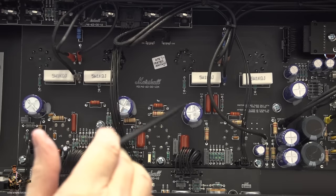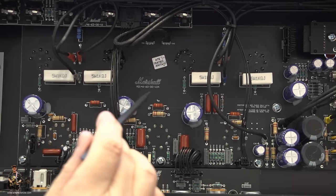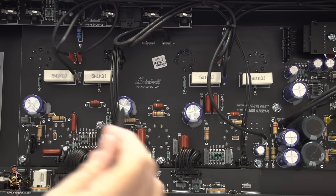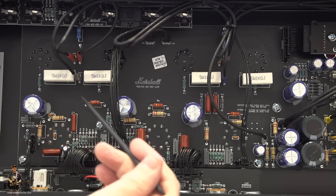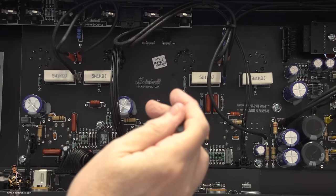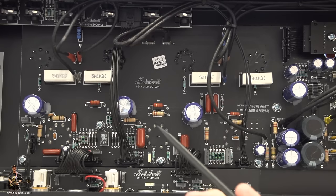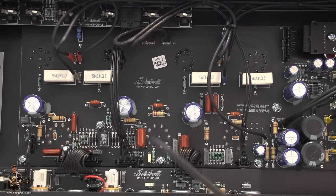It's flow solder mounting, these components. You can just tell. And I don't know, maybe these tube sockets were put in differently, because they look as if they'd been actually soldered by hand. The other ones don't. These look as if they were done on a machine, but those four up there look like they're done the other way, so to speak. You'll notice the quality of the board is pretty exceptional, really, if you want the truth.